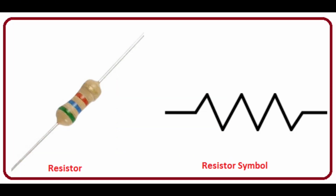We also need two resistors, which are simple electrical parts with two ends that help control the flow of electricity in a circuit. For this circuit, they slow down the current and reduce the voltage flowing into the LEDs to prevent the LEDs from overheating. And in this circuit, we use two 220 ohm resistors.